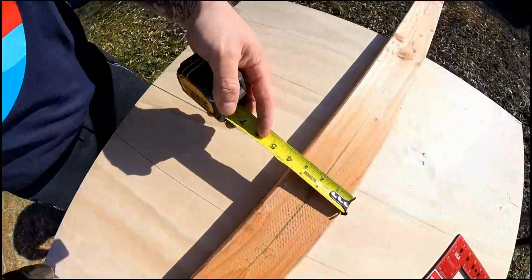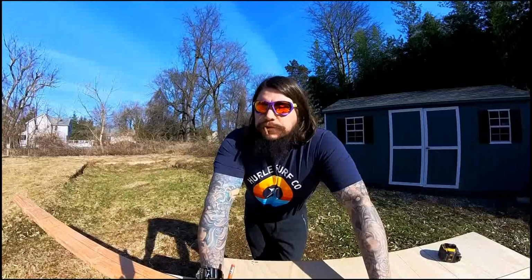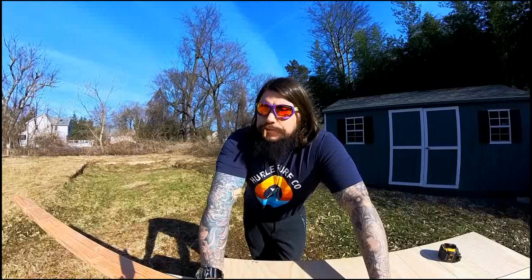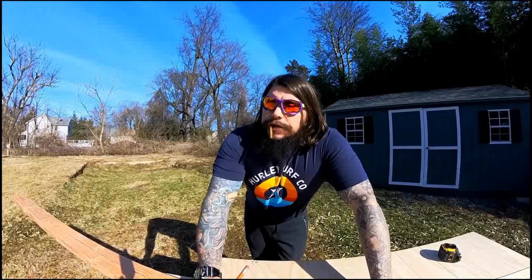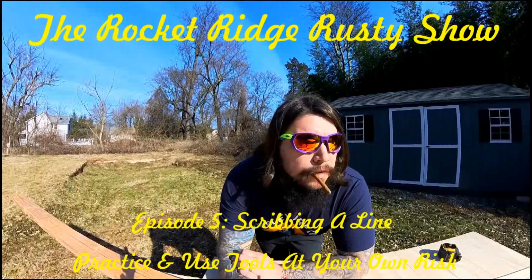All right. So you got your 1 3/4. You cut it right in half, right? It's right there. Now, obviously, you're not gonna be able to cut this perfect in the type of, let's say, finished trim work with a power saw. But you can do this for framing, multi-purpose pieces of wood, outdoor, exterior, different odds and ends projects. But if you're going to be cutting trim or molding, it depends how good you are with that saw, but you're not going to have the same control as you would with a table saw. Okay.